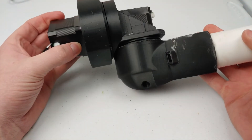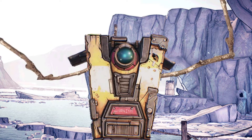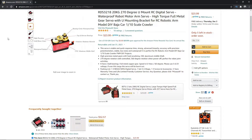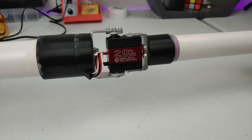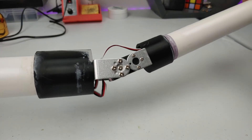Now let's deal with the elbow joint. Because Claptrap's arm is pretty much a twig I had to scratch my head for a moment. We can't use a gearbox like we did on the shoulder joint — they're just too big. We could use pneumatics or hydraulics, but I'm not a big fan of creating a whole other system just for a couple of joints. So I decided to go back to basics and go with a servo motor. I found one with the highest torque and a dual output, which was important to make sure torque on that joint would be evenly distributed. Here's what it looks like fully assembled — really just a PVC end cap with a couple of holes suited for the servo motor brackets.